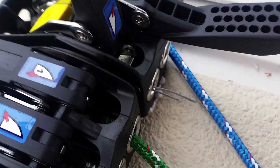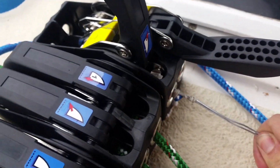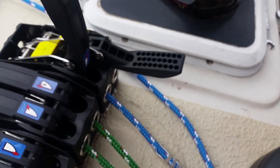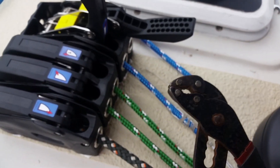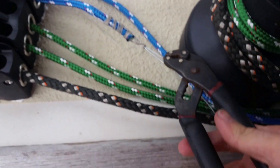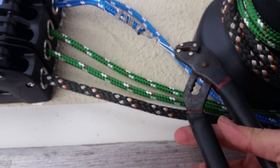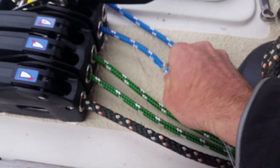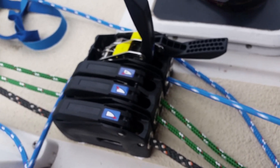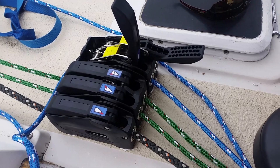You can see both legs popping out and coming out of the exit. Now at this point you might think you're done — all you have to do is pull it here and it'll come through. And a little bit it can get stuck. If it won't go through too easily, use channel locks — just grab onto the wire and pull it really hard. You have a nice large lever to grab onto. Then you'll just need to pull it all the way through and get ready to do the next one in the exact same fashion.